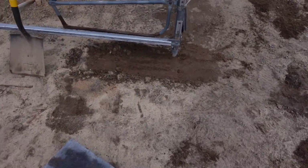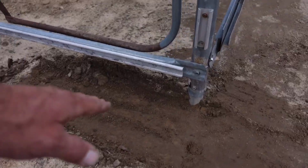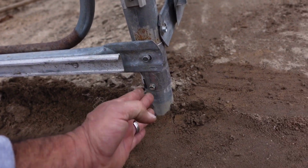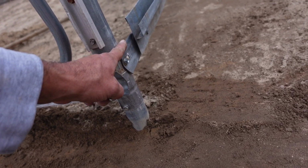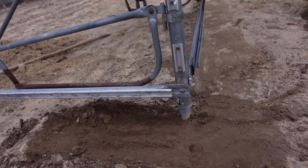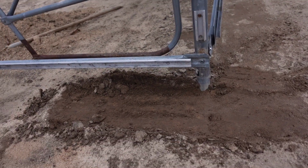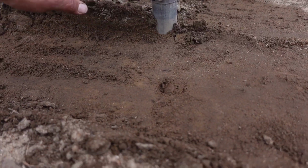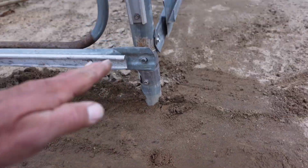And the idea for the front is to take the 2x6 and put it up under where you see this wiggle wire track, it'll go up under here and bolt to here. Now on this side, the 2x6 will be up here, and that's where the polycarbonate panels will sit. But on the front, we're going to put them down here, so I needed 5.5 inches from here down, so we're going to shovel that out.